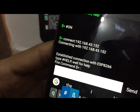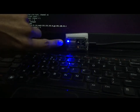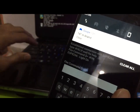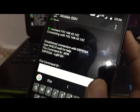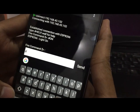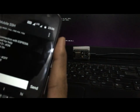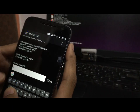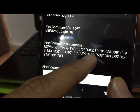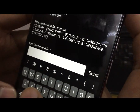Now I am typing the command 'hash on' — you can see the onboard LED is being turned on. This SSH server is running on my mobile data while my laptop and ESP8266 are on the home router network, so you are accessing your home network from outside. Now I am going to turn off the LED — 'hash off' — and it is off. Now fetching the status of my ESP8266 with the status command — it is sending back the uptime, IP address, and interface status.